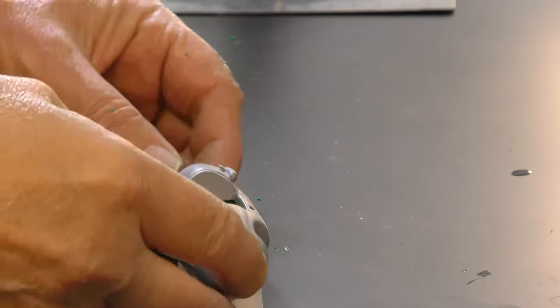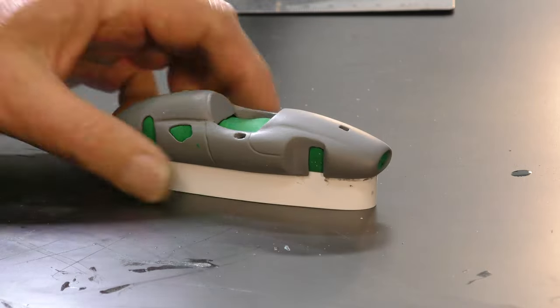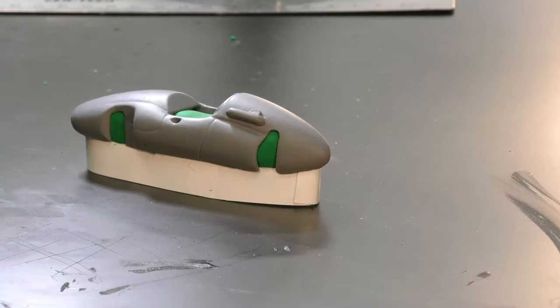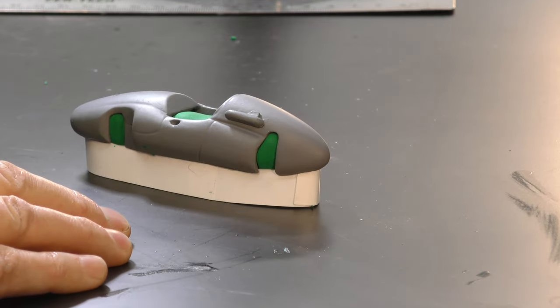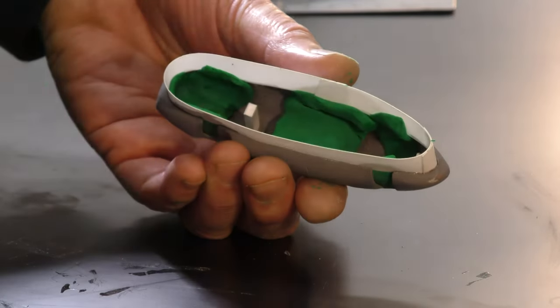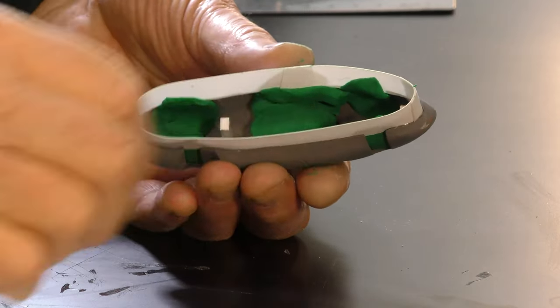So I got it clayed up here. I don't think we're going to have any leakage per se. I'm going to do a splash coat first on this to make sure after I put the silicone into the pressure pot and crush all the bubbles. And you can see there that this is just going to come straight out — I know there's an undercut here, but this will be flexible enough that I'll be able to get the core out, especially after I remove this wall, which I am going to do.